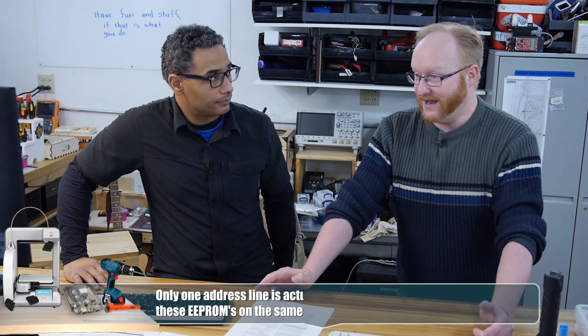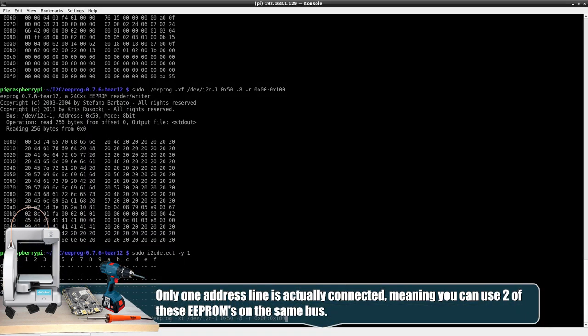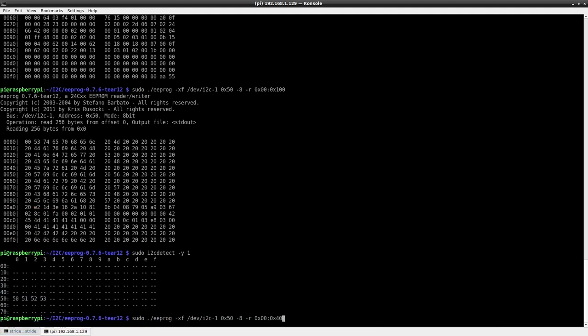Okay. So the fact that they have three bits here, A2, A1, A0, makes you think you could have eight devices on the bus, but nope, two of these don't do anything. But that's probably why we're seeing four devices. Basically, we're seeing one device and then three nulls. Okay. So there's a response, but it's not necessarily what we want.